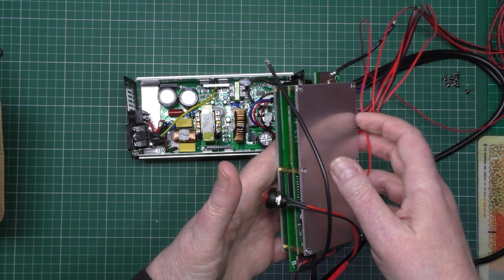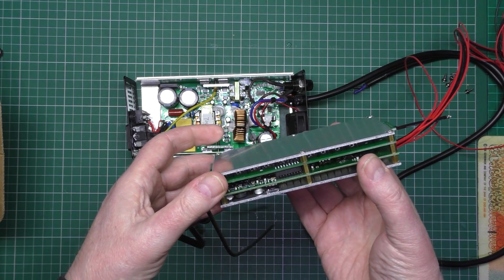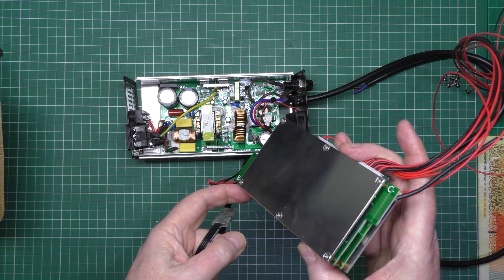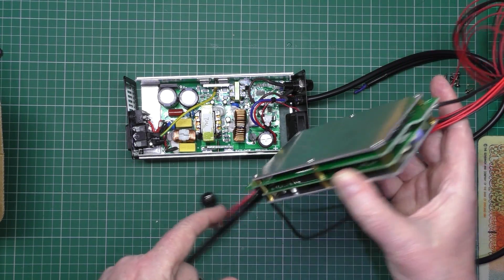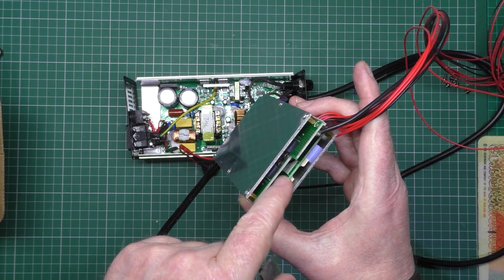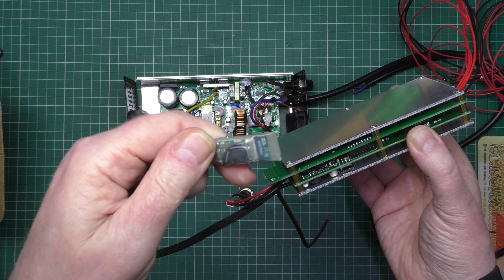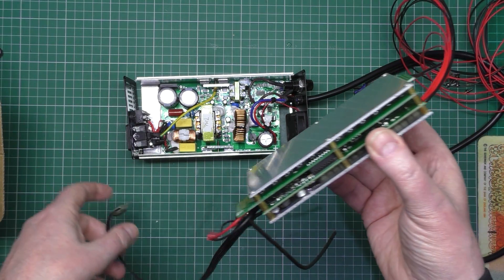This is the BMS that I've been working on, which is an absolutely fantastic piece of kit, but mine broke. The Bluetooth module, which is actually on-board, popped. There's a 3.3 volt regulator inside which popped. So what I had to do was — there's a 3.3 volt regulator on there — I've now got the Bluetooth external, which is even better because I can put it where I want and get a bit more range on it.